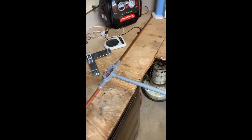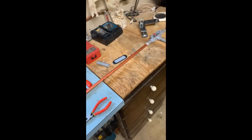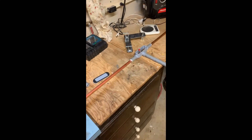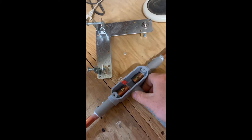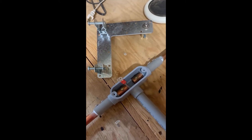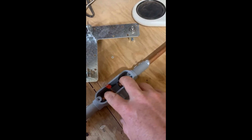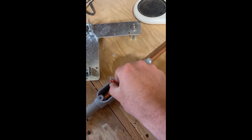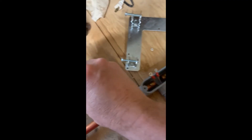The heart of this antenna is two copper rods. I have this rod here and this rod here — those are my receptors for the signal. I bought this PVC junction box; the copper goes into the junction box with the terminals and then the receiver wire here is going to screw to those two terminals, and then we'll cap it off with that cap there for the junction box.